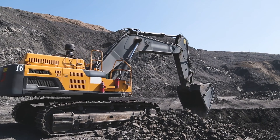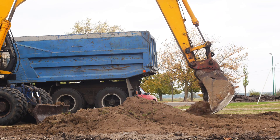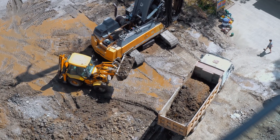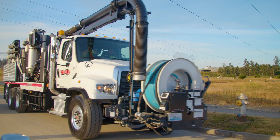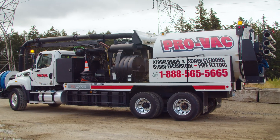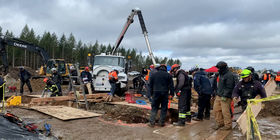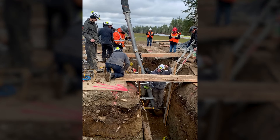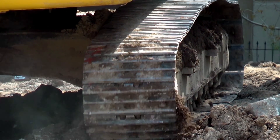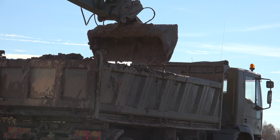With conventional excavating, you would use an excavator to dig the hole, then that material has to be put in a disposal pile, a dump truck has to come, a front loader comes and loads the dump truck. We're doing all of that with hydro excavation with one piece of gear. You can do a four-by-four hole, put trench safety in, do the repair, backfill it, and you're out of there — versus bringing in an excavator with all the cost and overhead for that heavy equipment.